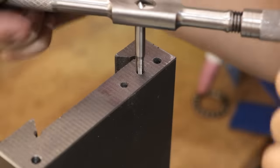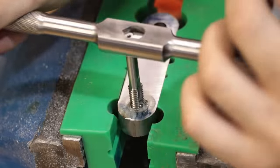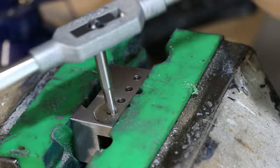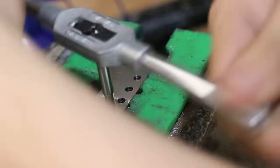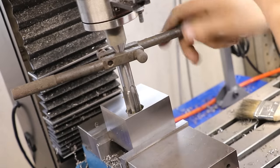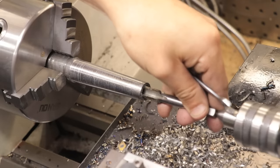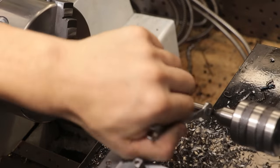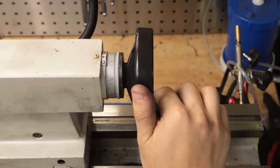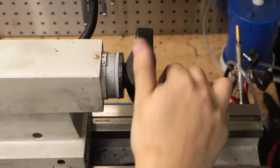Most of the holes that I do are good enough to be tapped with a simple taper tap, which does a pretty good job at making sure the hole is straight. It doesn't matter all that much if the threads for these tool holder screws are slightly off, but there are some other holes where it is very critical. On the milling machine I've resorted to applying pressure with the quill and a dead center, which works pretty well, but trying to do the same thing on the lathe is a lot more difficult. There's a lot less space to work with, and it's a lot harder to apply constant pressure with the tailstock. Same thing goes for backing off the pressure to allow breaking off chips — there's a lot of backlash in the tailstock handwheel, so getting the correct pressure is quite difficult.